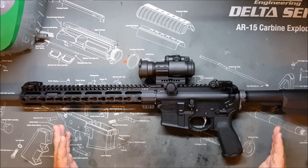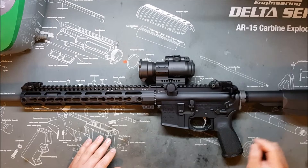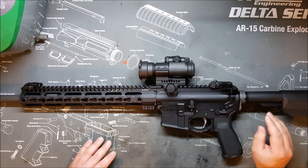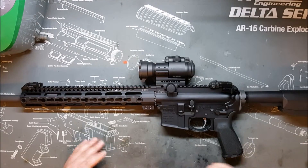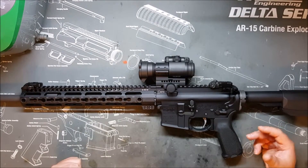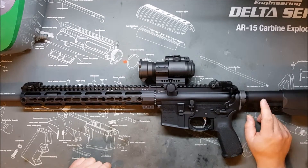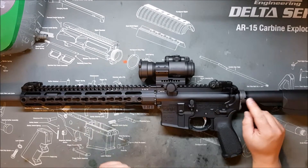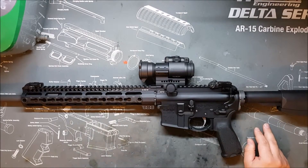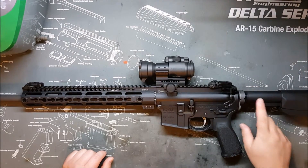Why is the commercial buffer tube different? It comes down to how the part is formed. In a commercial buffer, they form the tube and then cut the threads into it to thread into the back of the receiver. The buffer tube has to be slightly larger so the threads can be cut in correctly. On a mil-spec buffer tube, the threads are actually a larger diameter than the tube itself. The thread is cut in first, and then the tube is milled and cut down into shape afterwards — that's why you'll see flat spots at the back end of the threads from where the milling machine came up into the thread just a little.